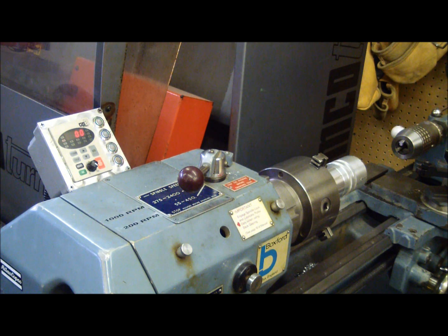This GS2 drive from AutomationDirect replaces a rotophaser. Rotophasers are completely antiquated because in this small package you can input single phase from your house, it converts it to three phase for your machines. You have infinite speed control, torque control, as well as a slew of other features.